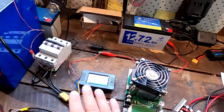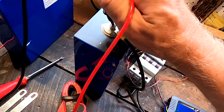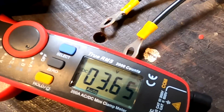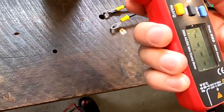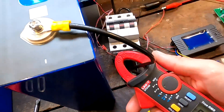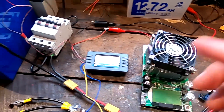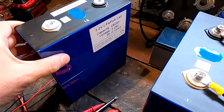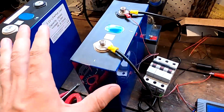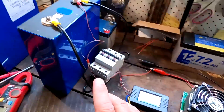Without further delay — I have almost fully charged this battery. We're at 3.65 volts and the battery still takes 200 milliamps, so it is 100% charged. I'll do this first test with this device, then use the second cell from the Carlotta delivery with the other meter and shunt for comparison, to see if there are any differences and get a better understanding of what's going on with these cells.